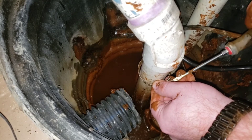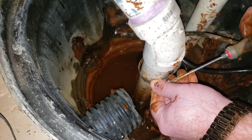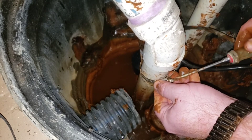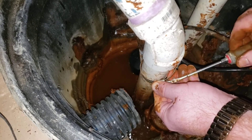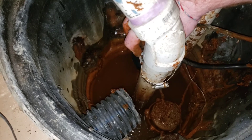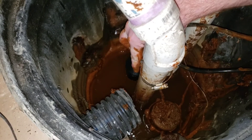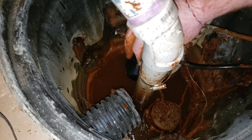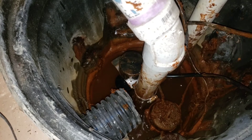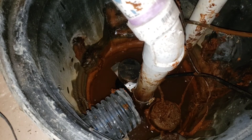Based on where the old one was located on the left of the pipe, I'm going to put this float right in the middle of the crock so the water's not hitting it when it drips down. I don't want sludge landing on it. I'll get it close to fully tight and then shimmy it down the pipe — remembering I want to keep it at least one inch above the bottom of the sump. I think I went a little too tight, so I'll loosen it just a little bit.